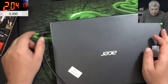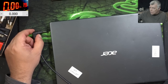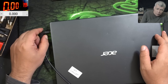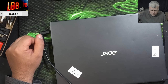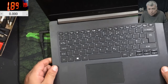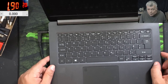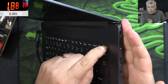Plug in the charger — wait, one second. I seen a lot of current there, let me lower the current. A current limit. It is charging. It was low current on the power supply. So we have 1.8 amps, 1.9 amps. We have the charging light. Pressing the power button and nothing happened. Like nothing. It should come on, right? You should see the light there. Pressing the power button — nothing happened.